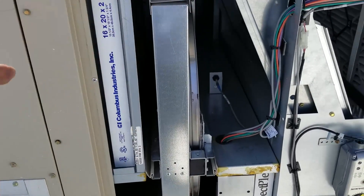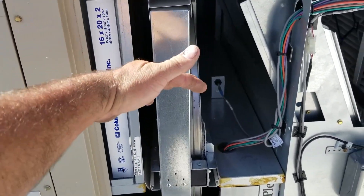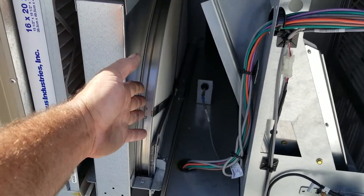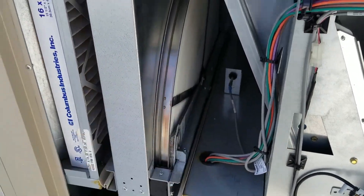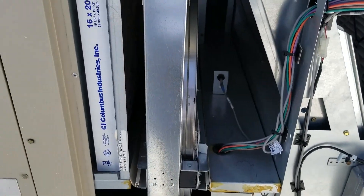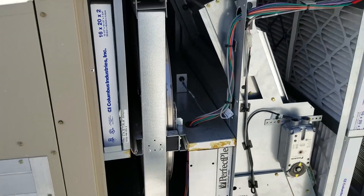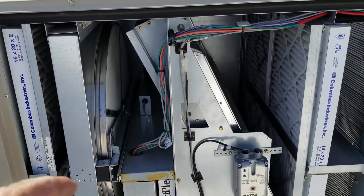Cool air leaving — now this hot, humid air passes through, and the air is cooled and dried, adding heat and humidity to the enthalpy wheel. Then you recover a lot of your energy. You can see there's a temperature sensor here, so when it's running you'll probably be able to see that. That mixed air temp recovers it.